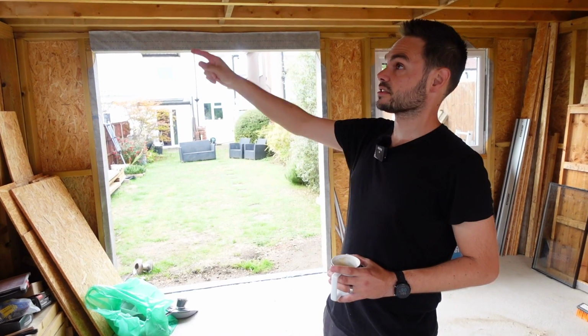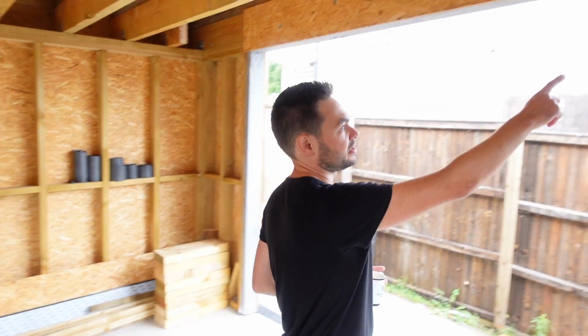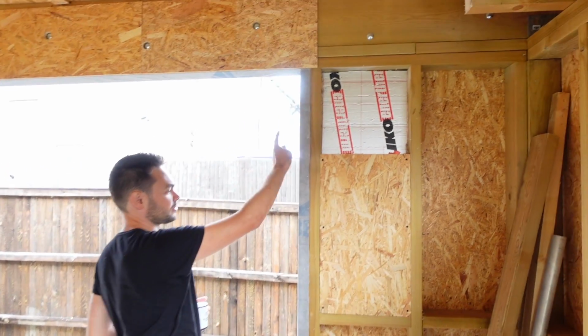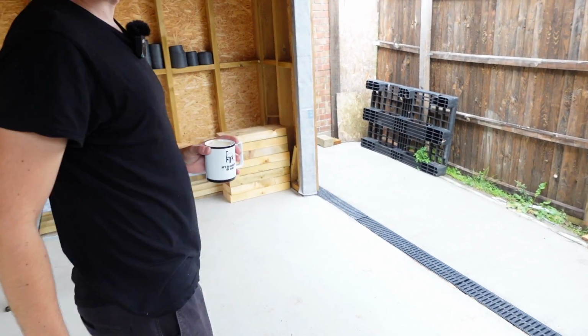in, and we just slung a couple of these on just to brace it, and then I built all of these ones in place, and I built this one. You can see it's got the header running all the way across. I built that as one, and then I chopped out the bottom just so everything's square. So you know it's square.